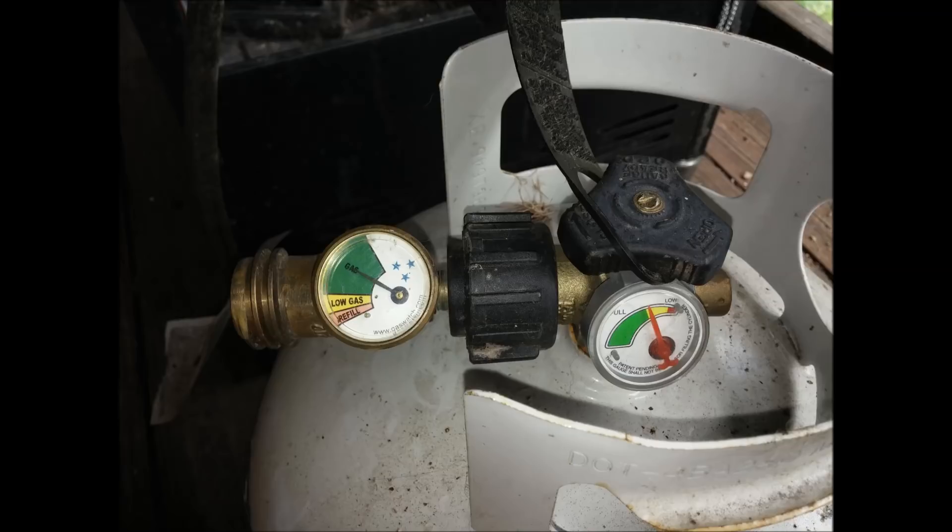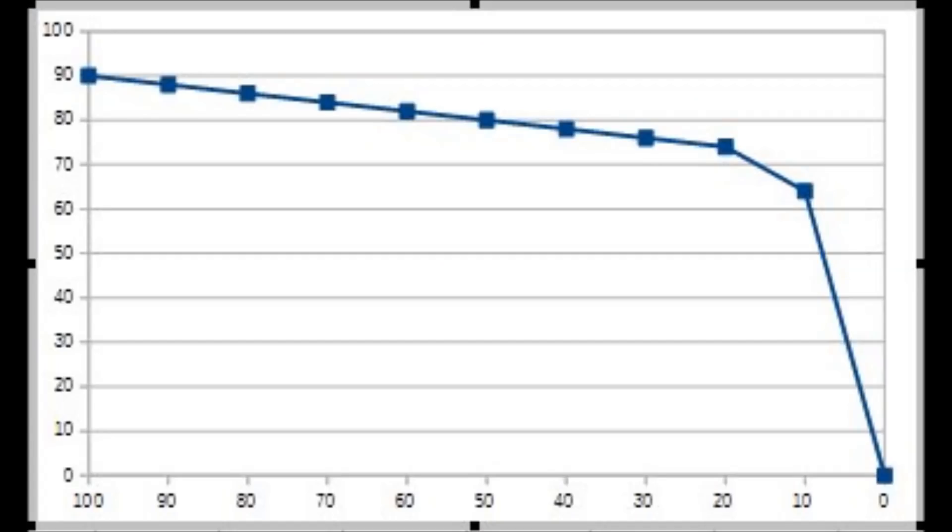Simple. You consider your tank full when it's filled with liquid propane, but you don't burn the liquid, you burn the gas. As a result, as you remove the gaseous propane from the tank, the liquid propane will boil and produce more gas. But that's not an even rate. The reason this gauge is not reading accurately is because I'm not currently pulling any of the gas out of the tank. As a result, it will actually rise to full if I gave it enough time. Liquid propane will continue to boil until the gas is back to 40 psi or so. The needle moves at all because when the tank is more full, less propane has to evaporate to reach 40 psi again. When the tank is empty, more propane has to evaporate to reach 40 psi. That's what the gauge is indicating as long as you're drawing gas. As soon as you stop drawing gas, enough will evaporate and it goes back to reading full again.